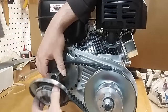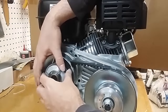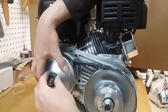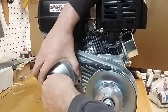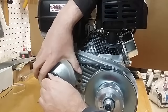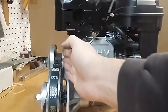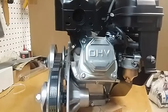Our cloverleaf keys in, our drive pulley slides onto the cloverleaf, our cover lines onto the flats, our spacer lines up with the keyway, and we finger-tighten the bolt. Give it a good shake to make sure everything is seating and properly aligned. Before we torque this down and make a second mistake, let's check our alignment. The belt now has a very straight shot — it's not cocked to one side or the other by a significant amount. That's what we're looking for.